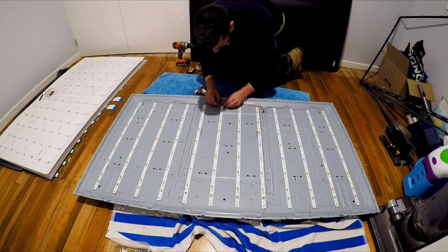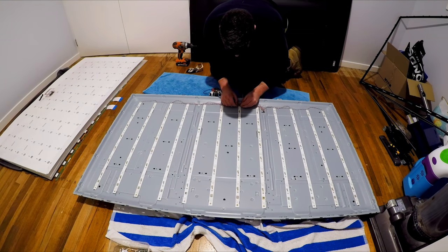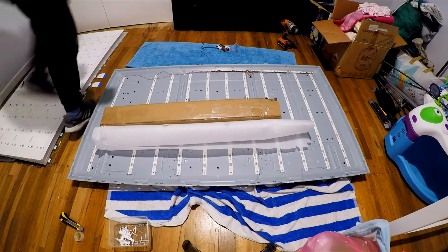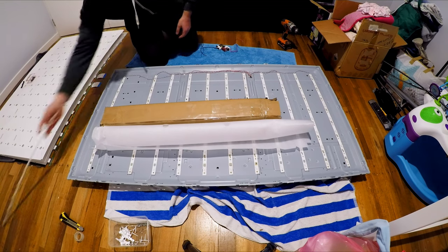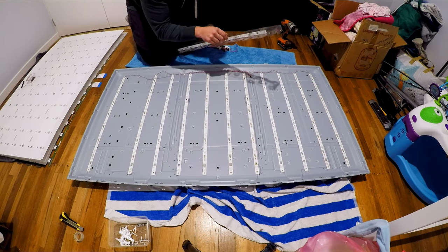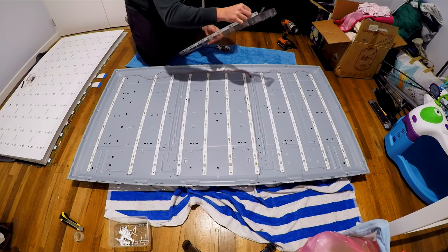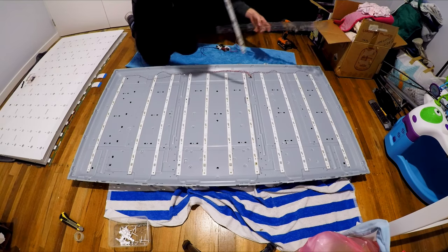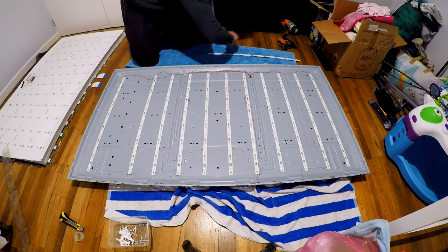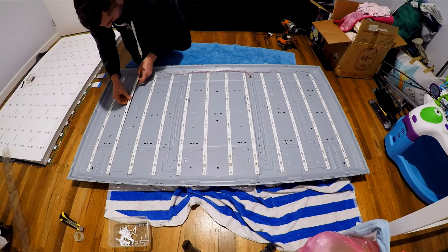After removing the last backing strip, go ahead and test all of your LED strips. Out of all these LEDs, I have one faulty light which caused the TV to shut down. So I'm going to remove the whole strip and replace it with a new one. Link in the description below. Now, you can do it on the cheap and just replace the one LED, but I'm not going to worry about it. A strip costs about $30, so I'm not going to muck around, I'll just replace it.